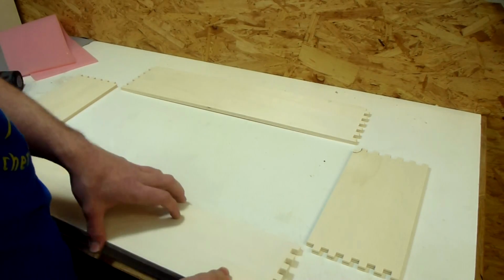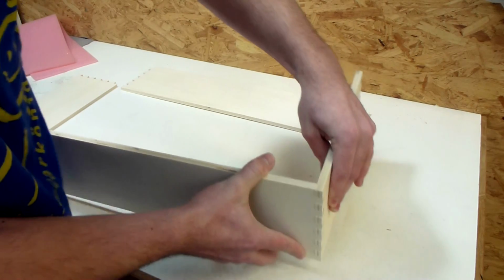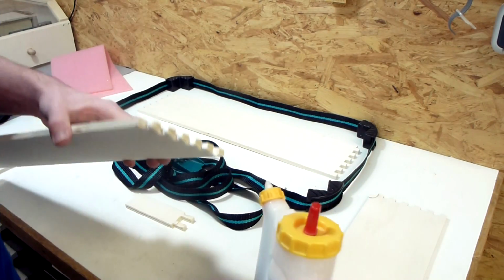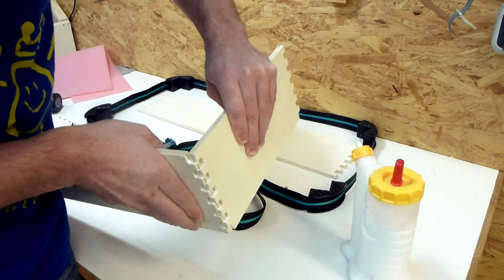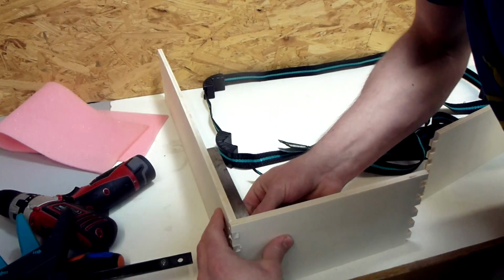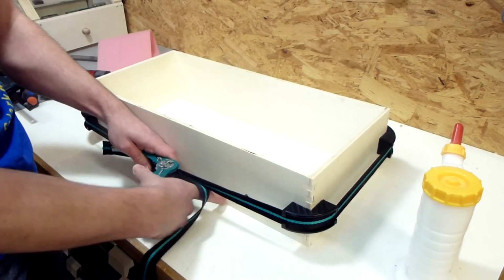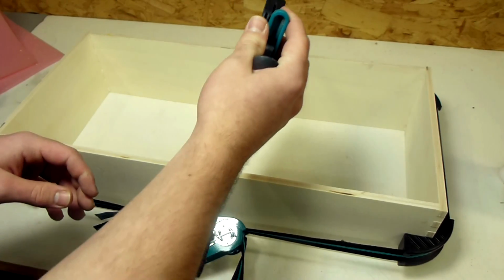So here are the pieces straight from the jig, no sanding needed so far. And they fit together perfectly, as usual with this jig. Making sure it's square. With thicker stock, these joints are pretty much self-squaring. A band clamp holds it in place while the glue dries. The plywood I used was bowed slightly and I tried to fix that with a quick clamp in its spread configuration. With the drawer body dry, I can now sand over the joints.